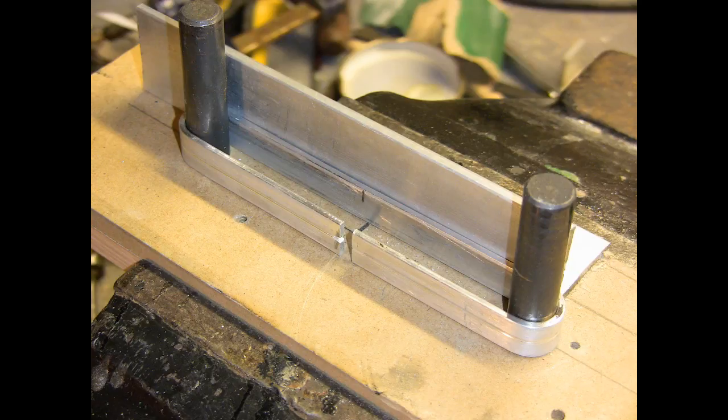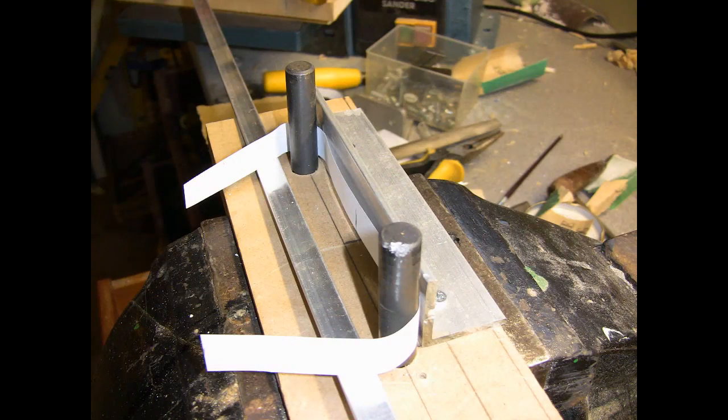I've determined the length of the link that I want. I've drilled two holes into a piece of MDF and put two of the same size drills in — that effectively gives me a jig, with a piece of aluminium angle stood up at the back. But how on earth do you manage to get a measurement for the strip of aluminium? Well, if you were Flintstone Engineering, you might use a piece of paper — and that's exactly how I did it. I wrapped a piece of paper round and that gave me a very accurate measurement.